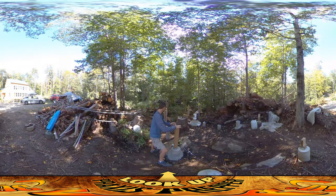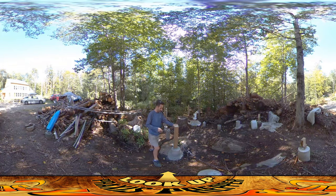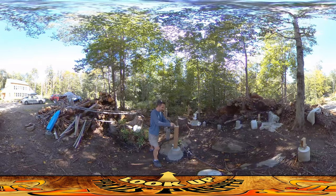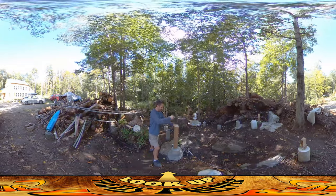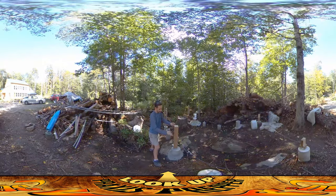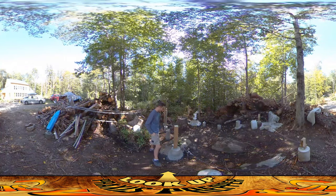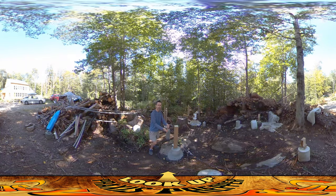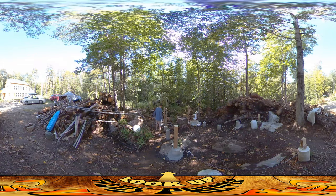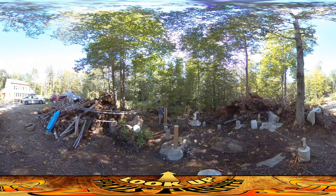I'm going to set this on — it's going to sit right on there. I've got a sledgehammer and I'm going to tap it down so it kind of bites into the nut at the bottom there. I'm holding them roughly vertical. Now this will be close enough. So I've got that hammered down, and what I'm doing first is this string here. I'm using the string to make a mark for where those two little side pieces are going to come in. Now it's pushing the string out, and that has the potential for maybe pushing the string down or up, so before I mark anything I'm going to come back here and do a sight across it to make sure it's a straight line.